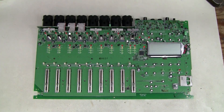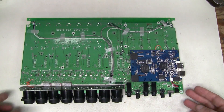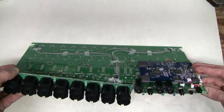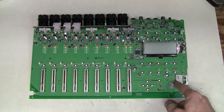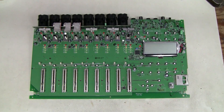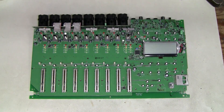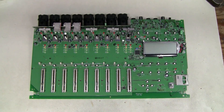I took this thing apart — I showed how in my previous video, so I didn't bother this time. Here we are. This version is cleaner; the other one had a lot of bodge wires. So this is probably a newer version of the PCB. Here is the SD card slot. I looked for cracked soldering joints here and I don't see any. It doesn't mean they're not cracked — they can be really hard to see. I think I saw a bent pin inside this thing, and it's hard to show on camera, so I'm going to try to shine some light right into the slot and take a few close-up pictures.